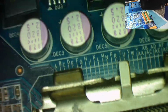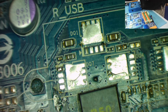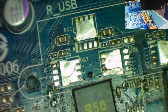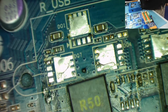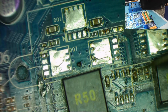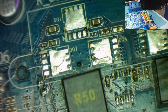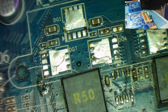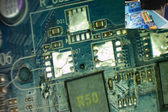Okay, so we know what the chips are. I've got the parts because they're quite common. From bad caps, I've found out what they should be. So we're going to have to replace 3 resistors that are missing, a couple of 1R0s, a 2R2, and the FETs. So what I think we'll do is we'll do this phase on the video because it's the most difficult one anyway. It has this chip. And then once we've done that, I'll go offline and do all the rest, and then we'll come back when everything's replaced, and we'll see what this board does. Okay. So let's start soldering.